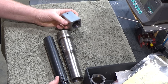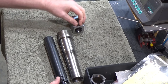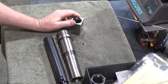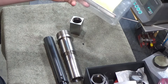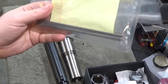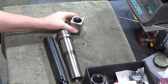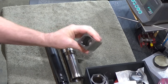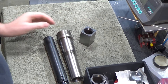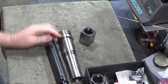I'm totally winging this next part of the design — I haven't pre-designed it, I'm just trying to figure out what I want. This is a 5C collet block and it's going to hold an emergency collet that will be bored out to the diameter of these needles. There are going to be 5C emergency collets made for a variety of different needle sizes. I need something that holds the 5C collet in place — I don't need the alignment pin because that'll just add drag. Its only job is to lightly hold it enough to let it rotate, so that should be very straightforward.